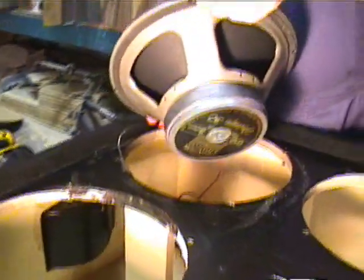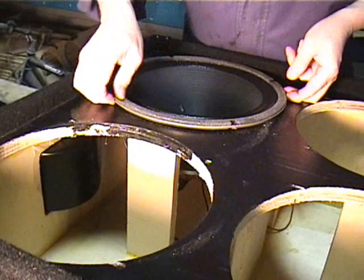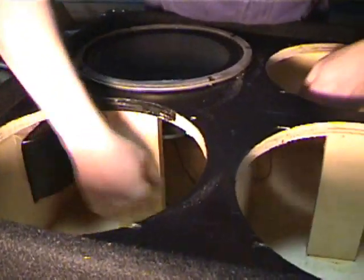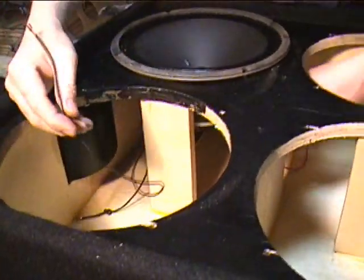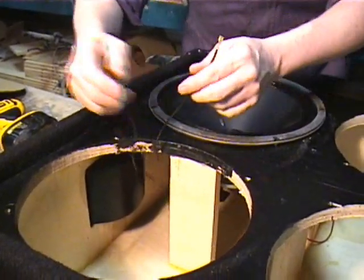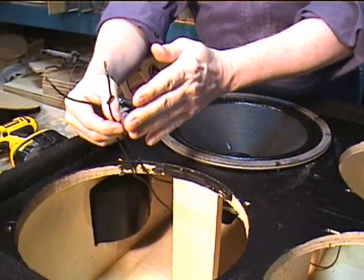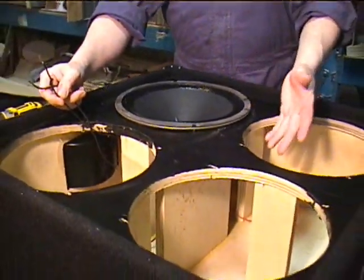You've also noticed that we're using a gasket here. This is one that we put on by hand, set up perfectly for this — a really nice closed cell gasket — and we line it up to the driver. Now I reach down, and there's my ground wire and there is my hot wire. Remember, this is coming off of the ground of this speaker to the positive of the next speaker. This is what you call wiring this side of the cabinet in series. Yet because the two grounds back here and the two hots up here are in parallel, you get what's called series parallel.